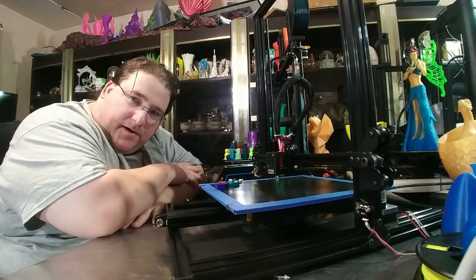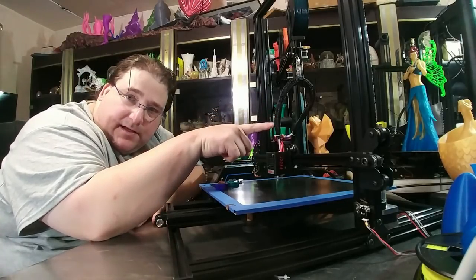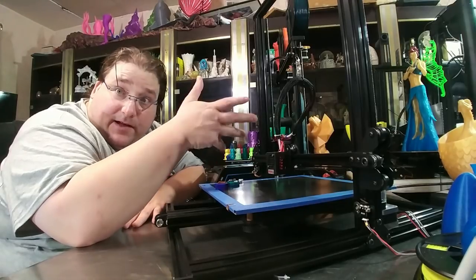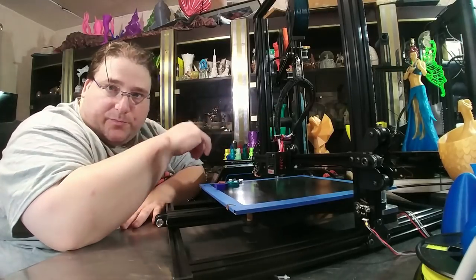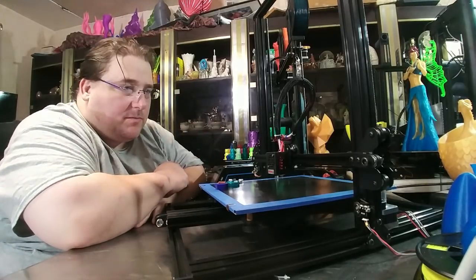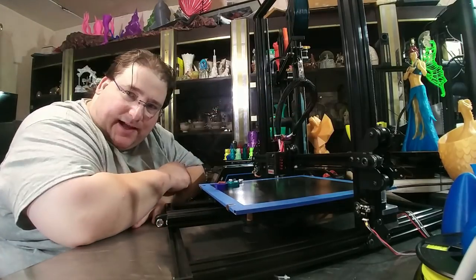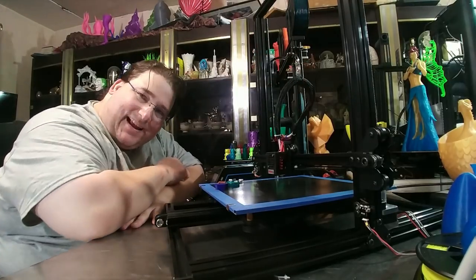So what is the droop? The droop is when this loom here — your Bowden tube and your wiring harness — they're very long on a printer like this because they have to cross a 300 millimeter bed. This is an even bigger problem on a 4x4, 4x5, or 5x5 printer like the CR-10 S5, the G-Max clone, or something like that. Anything with a 300 millimeter or larger bed will experience this problem. Even CR-10 mini people might have similar problems — I believe the bed is 300 millimeters wide on the mini. This will droop down and sometimes it can droop down into your print, and when the bed moves back and forth, this wiring loom can snag a part of your print and damage it.